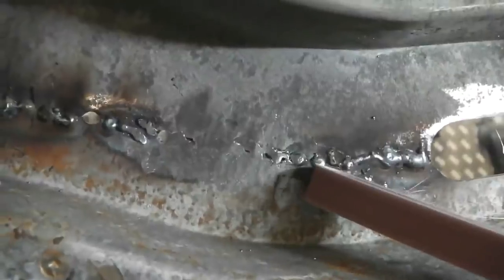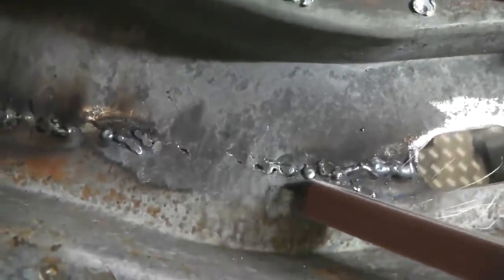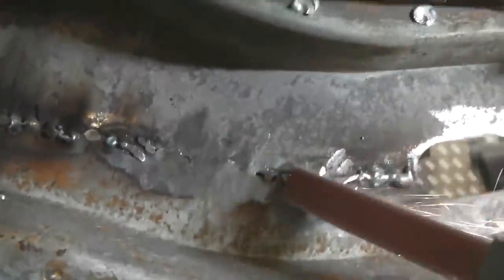Even the Portuguese donor section of metal's on its way to being pitted, you can see there. And that was a solid car. So, I mean, there'll be cars on the road that have got all this, and you don't even know it. Them belts that I'm using are from Screwfix, and that area that you can see on your screen now would use a belt up easily, if not two belts. So you soon blow through the belts. They're 60 grit belts, and they'll last.